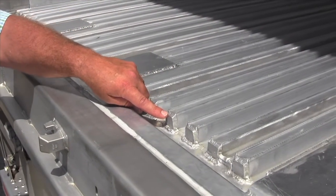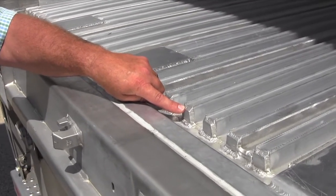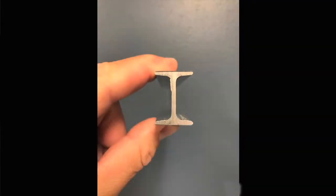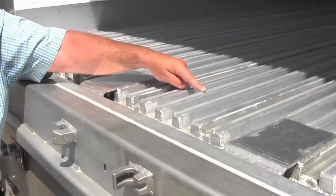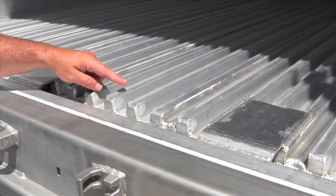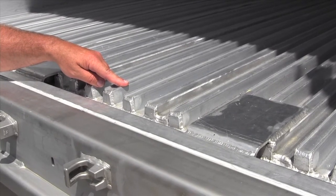Pure Blue's floor design includes solid aluminum plugs at the end of the ducts in the duct board floor to prevent crushing in service from dock damage. It also includes a 1-inch I-beam that's inserted into the ducts in the center 72 inches of the rear of the floor and extends up 3 feet. This adds additional strength to the rear of the floor to provide for long service life and prevent forklift damage.